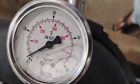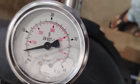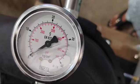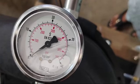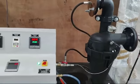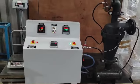We can check the increasing and decreasing pressure on this analog pressure gauge. Here you can see the pressure has increased up to 4 kg. Now it has held for 4 seconds and drained down to 0 in 4 seconds. Now again it will hold for 4 seconds. This is how we can test a hydro cyclone filter with the help of a cyclic pressure tester machine.